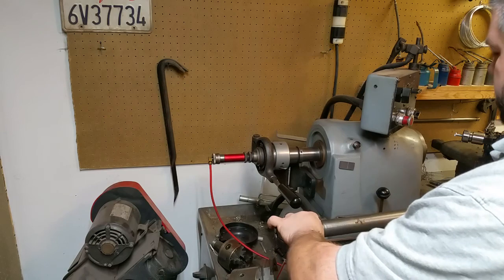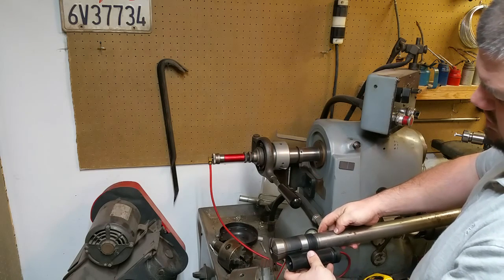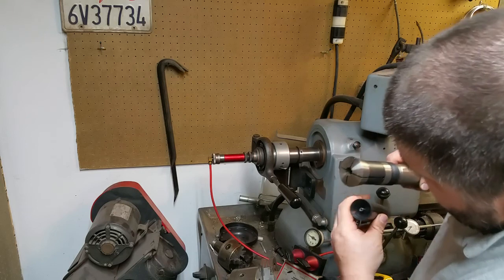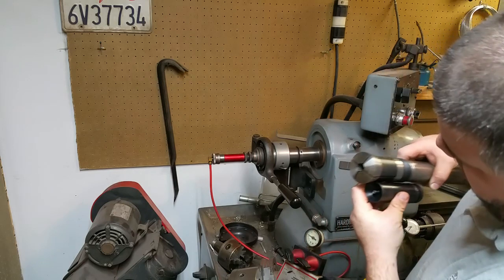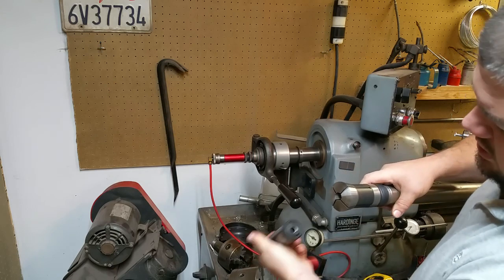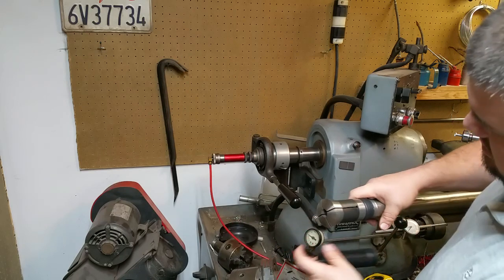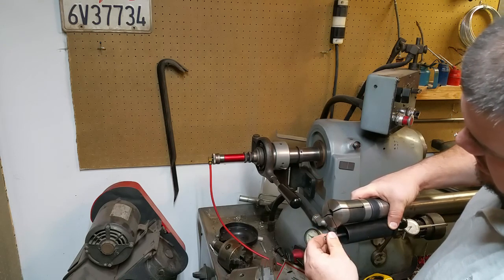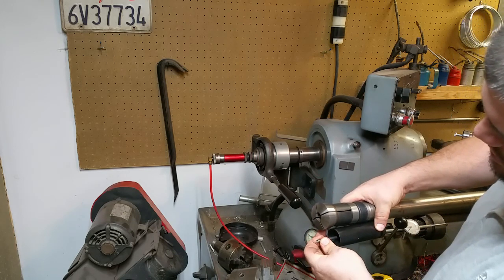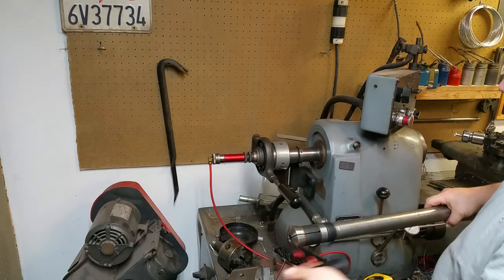Because it's limited in the length it can push material out, this is long enough so that as it comes forward and hits the back of the actual collet, it's still inside the bore and will still retract and feed. There's a little hole through here and you want the bar end to come out. What I did was put a telescoping pneumatic piston in there so that when this hits a stop, the little tiny piston continues going and actually pushes the bar end out through the collet. So this pushes to that point, air pressure builds up, and then the small piston pushes the remnant out of the collet so you can feed material back in or retract the piston.